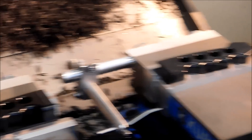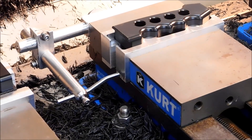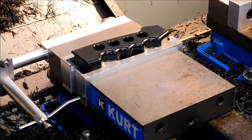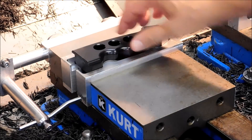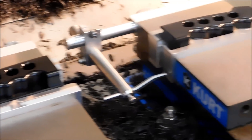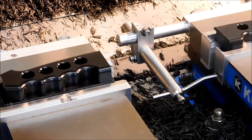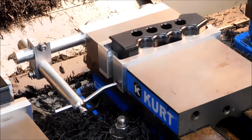Because of the smaller — not limited, but smaller than a thousand-piece production run — I'm using two vices. One vice is equipped with a jaw profile that's milled out to accommodate the net shape of the first op. The first side uses strictly a set of aluminum jaws with ridges milled into them so I don't have to use parallels. Let's pretend this is mid-break and just see how it's going to go — let's change them over and push the button. I'll accelerate the full product cycle time so you don't get old watching it.